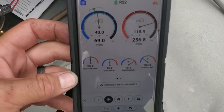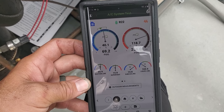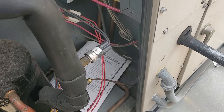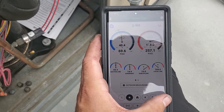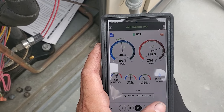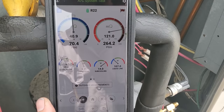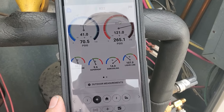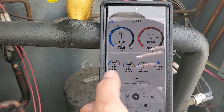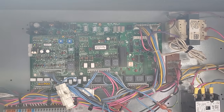This is the first stage — you can't really ask for much better than that. Remember the subcooling reads a little bit higher than what people normally expect because we're using discharge pressure. But these units don't really use subcooling as their charging metric anyways — they use approach temperature. Temperature splits a hair on the low side but we're still stabilizing. My second stage is pretty much doing the same thing. 10 degrees superheat, TXV is working, 15 to 14 degrees subcooling. That's not bad. Temperature split, like I said earlier, it was still stabilizing out and it's much better. I don't see anything wrong with this unit other than a potential electrical problem and the board was basically bricked and locked itself out on those fast flashes.